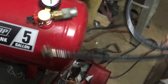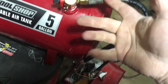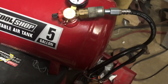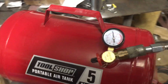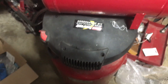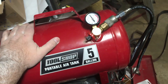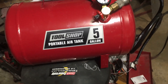Now I can take this off, plug it into my air hose, fill my tank, plug it back in, put a different air hose on it with an air gun, or even run a small brad nailer with it a couple of times before there isn't enough air to sink the nail head all the way. Just any number of applications where maybe you don't want to drag a portable — or not-so-portable — air compressor around when you just need a few pounds of air or a few PSI to do something. All for less than $30.